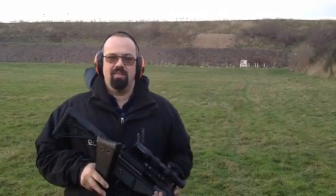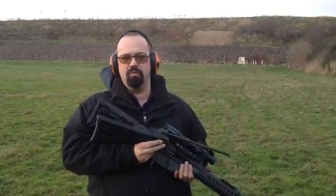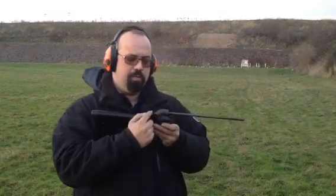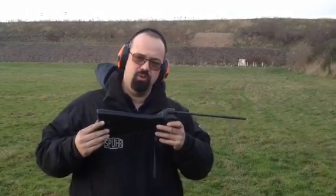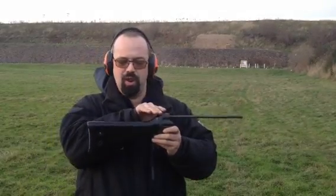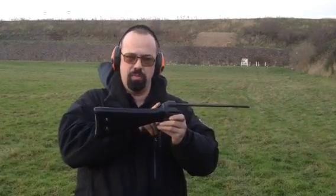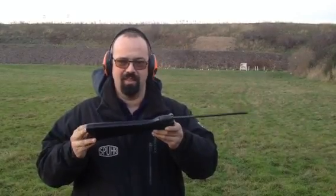The problem with the G3 is the ergonomics — they really suck. If we take the original stock, it's about three inches too long, and it's three inches too long because of the hump. The hump is this piece here where the comb is lowered so you can see the open sights. But today, in 2012, we are not really using open sights that much anymore, so we don't need a hump anymore and we could actually make the stock in one height. With the hump, you get it in your face and this hurts, especially from prone position, and due to that they have lengthened the stock very much, which is very annoying.